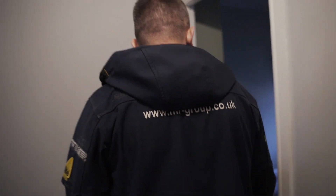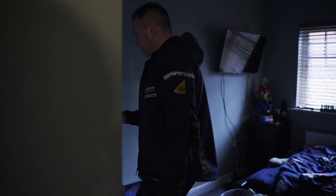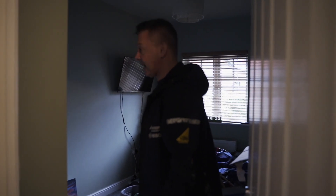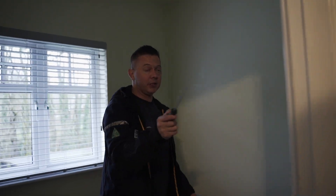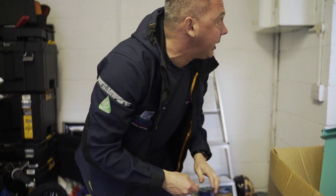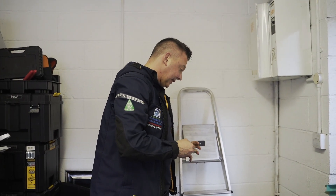So it was just an airlock. It's up to him whether he wants to go ahead with a new boiler. What we'd have to do is get a hot feed - the boiler is roughly over here. There are two ways: get up into the attic and straight across, run a feed. Looking inside the garage it might be here, could even be in one of these cupboards. We could just run the hot over. The reason I mentioned these boilers are a bit dodgy is some people don't want to go over to a combi.